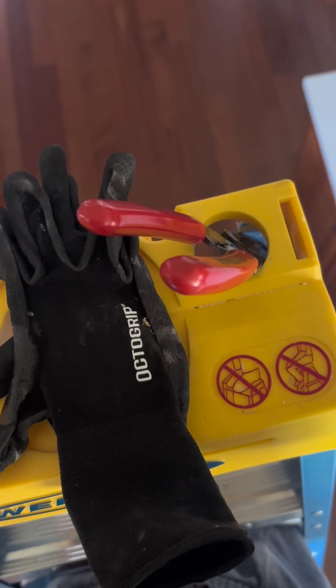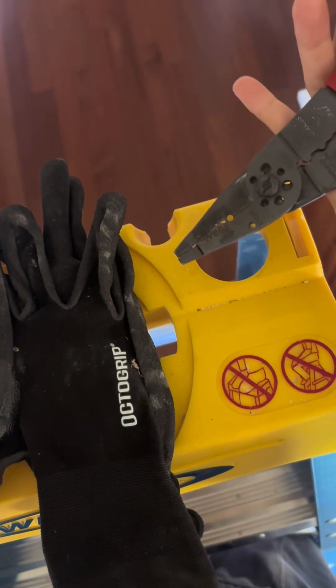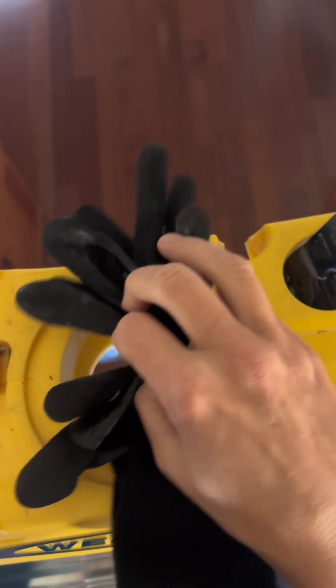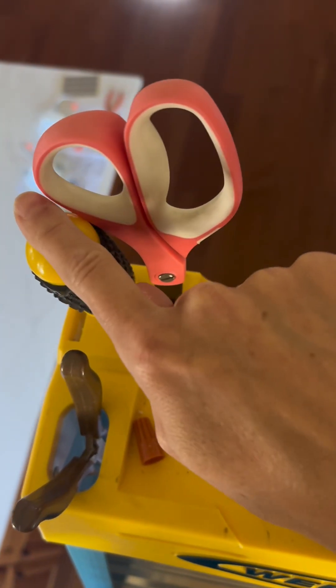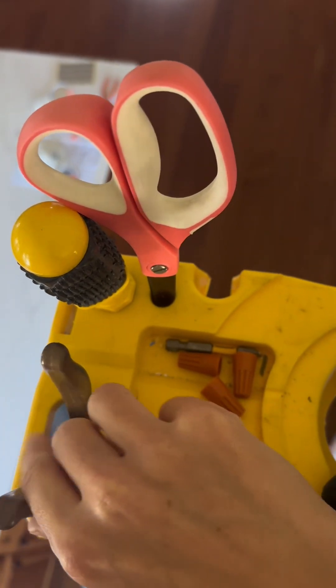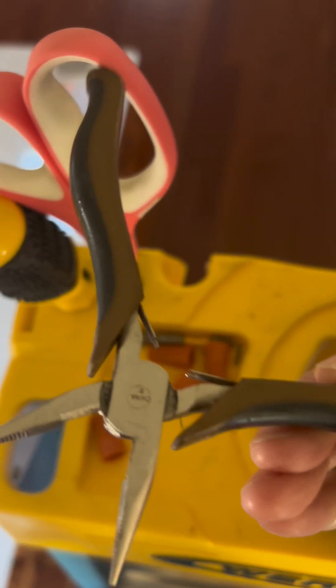Before starting, turn off the power at the breaker. I have here wire cutters, strippers, some gloves, extra wire nuts — you may or may not need those. A stubby little screwdriver, scissors, and pliers are very handy. Also very cool is this headlamp. You can put a flashlight in your attic but it might mess with the insulation — happened to me and it looked like snow all over my floor. And these glasses here to protect your eyes.